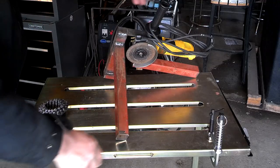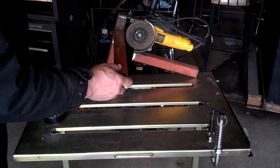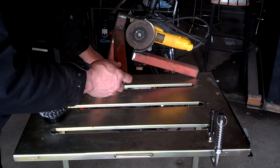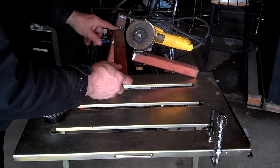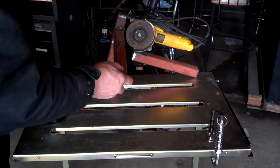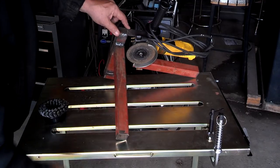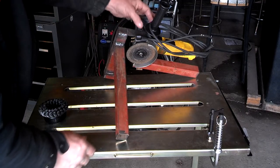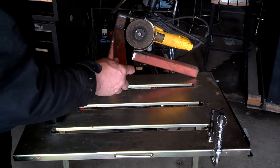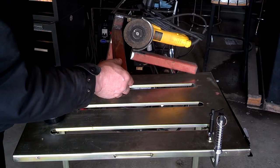It's a pretty nice tool, actually. It's welded up from just some scrap square tubing that I had — a 2-inch piece, a 9-inch piece, and a 14-inch piece. And then for the hand unit there, that's a 12-inch piece. There's also a piece of flat steel welded across here that you actually mount your angle grinder to, which in turn makes a bench-mounted grinder.